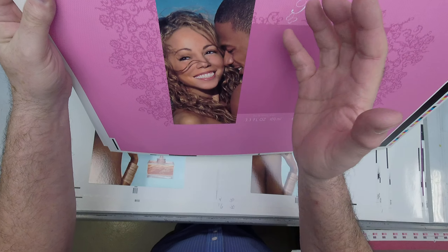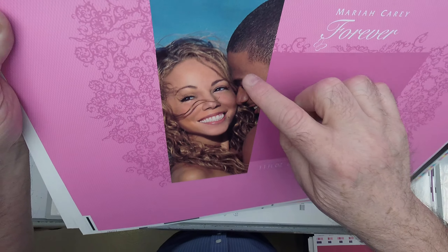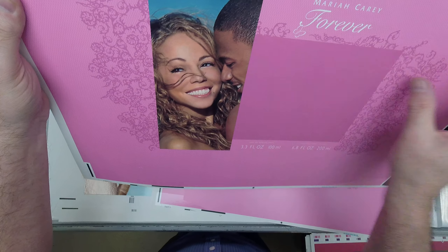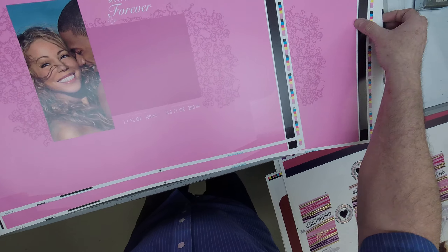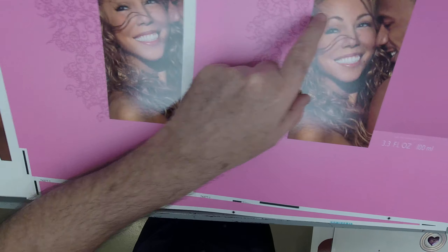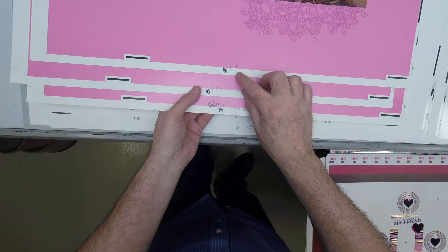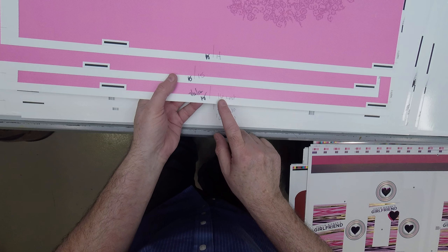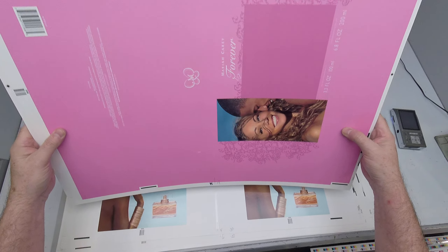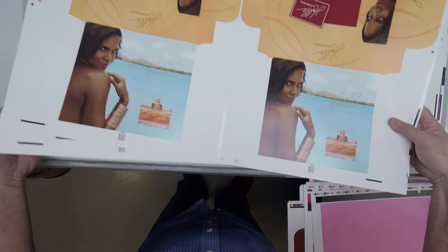Interesting — I tried to brush that off the sheet to see if it was paper lint or something. There's a hair, either an actual human hair or a paper lint fiber. If I go to the next press sheet, look right there — on the next press sheet, it's gone. These are different press sheets: a sample off of load 14, a sample off of load 15, and a sample off of load 16.